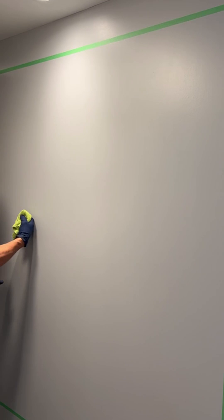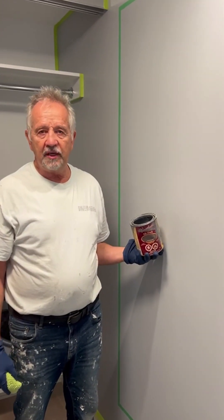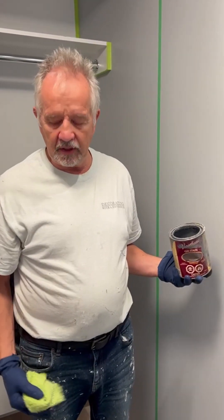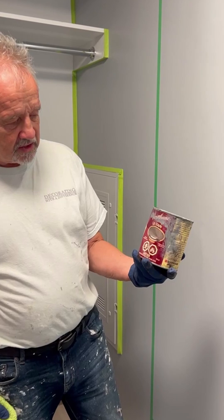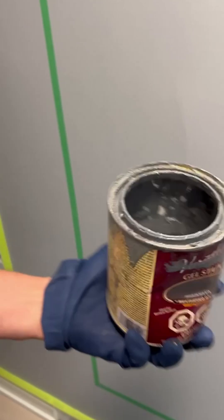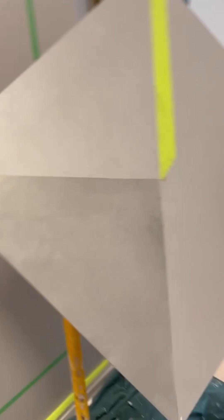We masked it off, as you can see. We've got a base coat — two coats of a satin acrylic — called Thunder Cloud, I believe. Then I've got some gel stain; this color is called Weathered Gray. It works pretty nicely over this color, and I made a sample — you always do that first. Here's a sample; that's the color. This is the suede look we're going for.